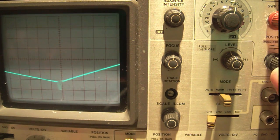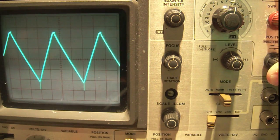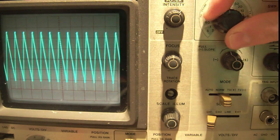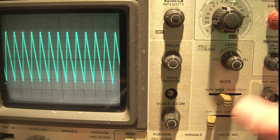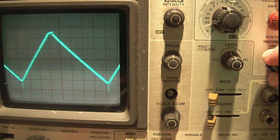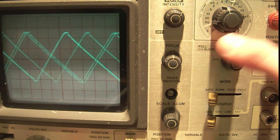And we can see that my signal's a little jittery, but they're about half a division. Right? And we can actually scroll through the whole signal that we're triggering on with a times 10 mag view. So if we switch it, oh yeah, my trigger's not the best, guys, sorry, but you see it's like that, and now if we pull it out, it's magnified by times 10. So that's really a neat control that you can use, and if you're using the mag, you may want to turn your intensity a bit up, because the mag is pretty demanding for that, right?